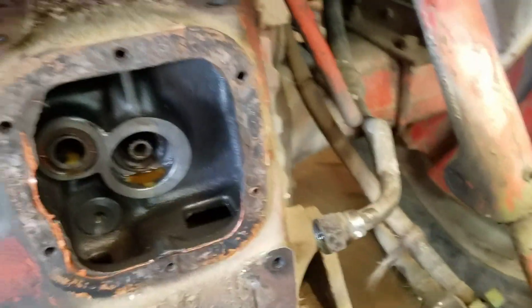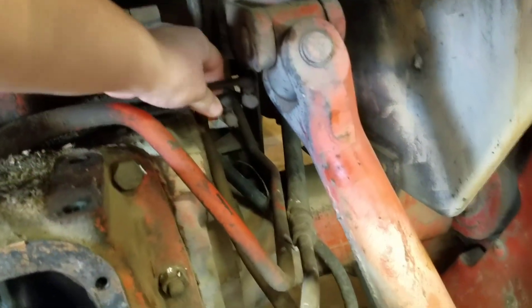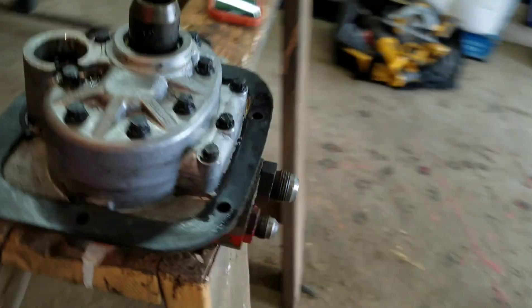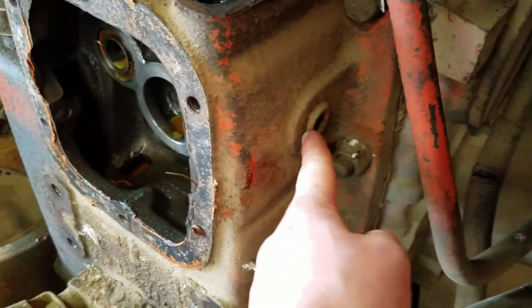While we're here on this particular one, we're going to have to fix a spring in here because the one remote lever won't find middle — it keeps engaging. We have all the stuff to put the hydraulic pump back together, and then we'll just have to plumb that second smaller auxiliary line for power shift, power steering, and power brakes. If you need it, plumb it right through that plug and right back into the tub and it'll be just fine.